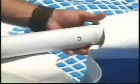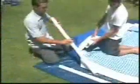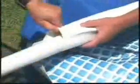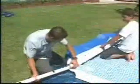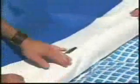Finish the side with a C beam. Keep the metal beam aligned with the white sleeve holes. Slide the beams into the other side in the same pattern. Assemble the beams in the ends of the liner, starting with a D beam, then an E beam if included for your pool, and ending with an F beam. Again, check the hole alignment with the sleeves.